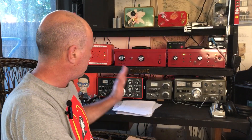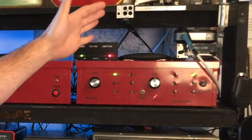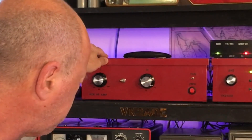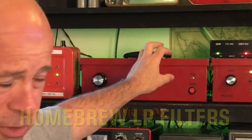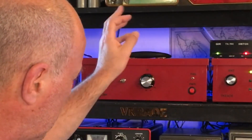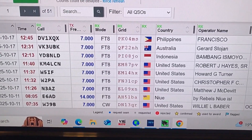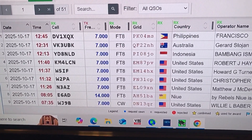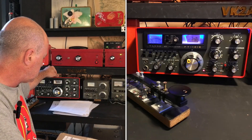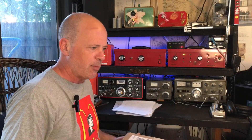People that have subscribed to the channel will know that I do build and refurbish gear. If you look at what's behind me, the antenna box that switches antennas is homebrew, my keying arrangement for my Hermes Lite is homebrew, and this linear amplifier for the Hermes Lite was a cheap Chinese kit that blew up straight away. I put some of my own field effect transistors in it and it's doing about 45 watts now, working really well. I had it making contacts last night - Philippines, Australia, Indonesia, and three or four stations in the United States, all on 40 meters. There's also a refurbished Yaesu FT-101E and a refurbished TS-520, both of which I've been inside and changed lots of parts.